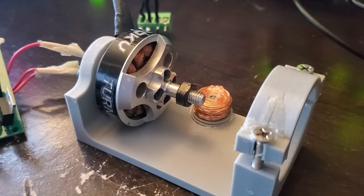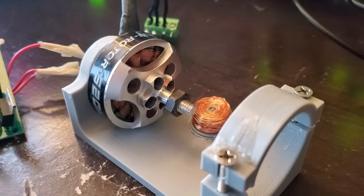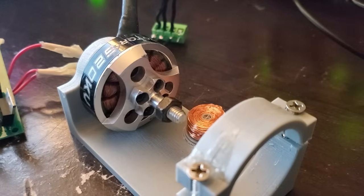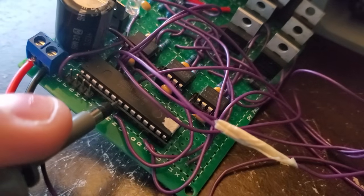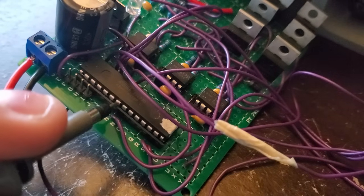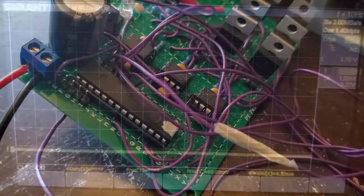I made those changes to my circuit and fired it up — but it definitely shouldn't be doing that. After some debugging, I figured out that the inrush current was creating a big enough voltage spike to reset the ATmega chip, which is why you see it start up for a second, stop, and keep trying again unsuccessfully.